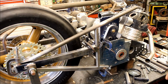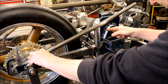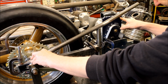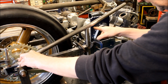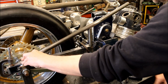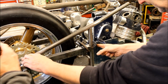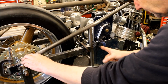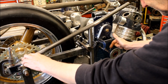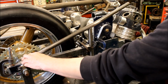The other thing is, what we wanted to do, now that we've gone back to here, is the plate that we've made for the supercharger. I can put a mount in there, bringing a mount in for the back here. You made that plate to match the back end of the old frame, and that frame's now different. If I put the lug here off this plate and put a spacer straight through, it hits the chain, which is no good. Ideally it could have done with being about an inch taller there, but unfortunately, it's not.